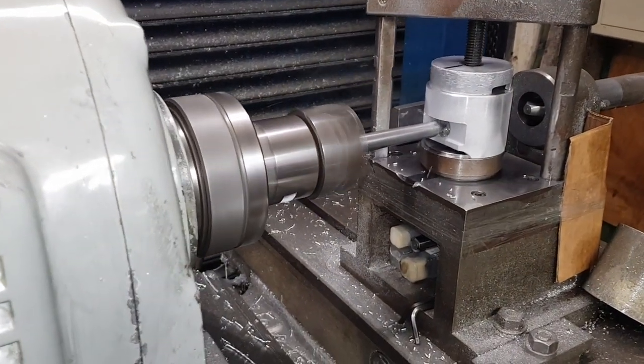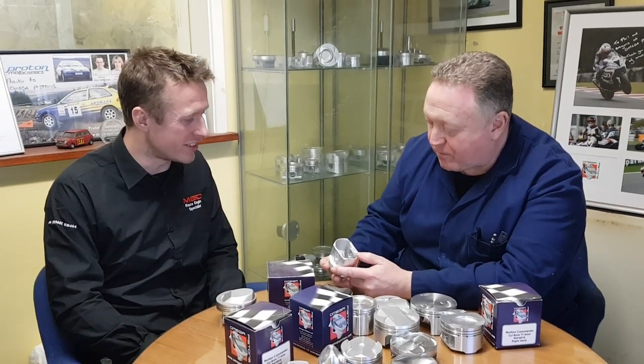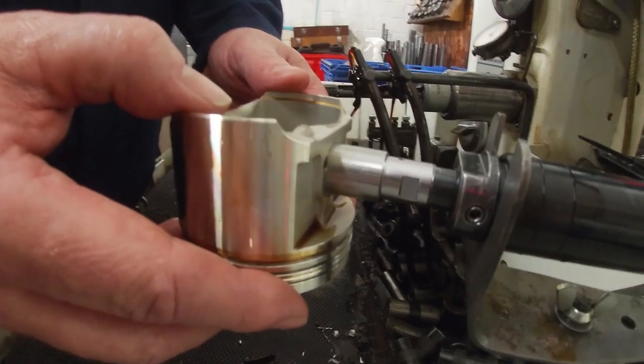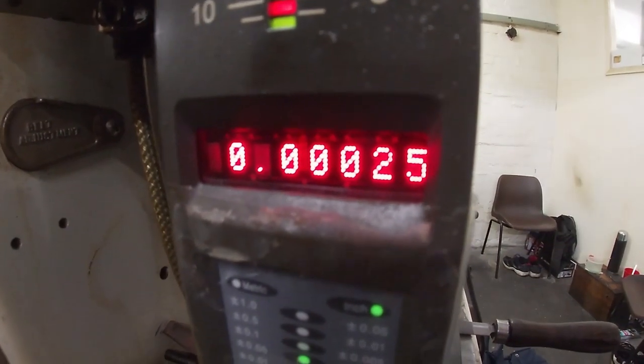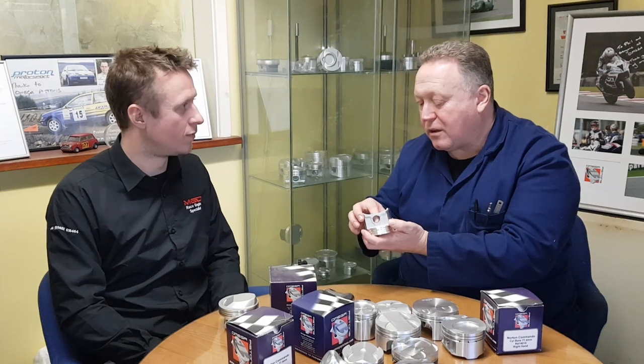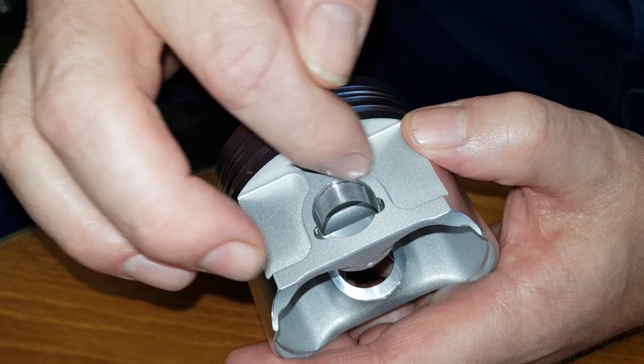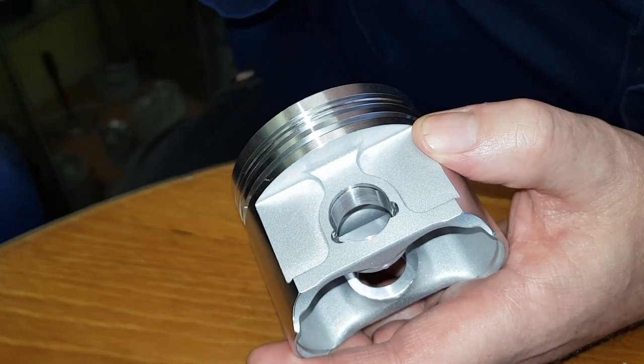So you know full well that the forged mini pistons are going to last. Are they built to the same tolerance? Yes — everything here is made the same. We over-engineer some pistons, but you have to do your best every time; you can't cut corners. We put two to three tenths of a thou clearance on the pin, and it doesn't venture outside those sizes — every single one. The honing also puts a crosshatch finish in the bore, which helps with oil retention, a bit like on a cylinder liner. If you had two smooth surfaces like a pin and a smooth bore, they'd work like a slip gauge — stick together. You want some roughness. Same with the piston skirt — it's not smooth for a reason; it's like a really fine screw thread that holds the oil.